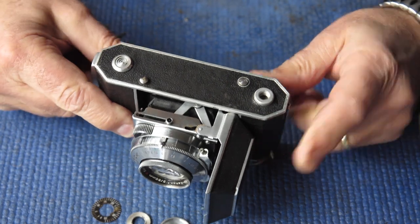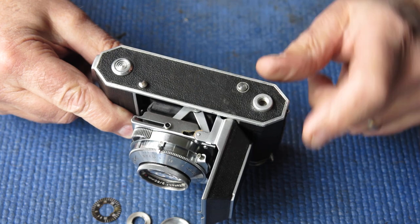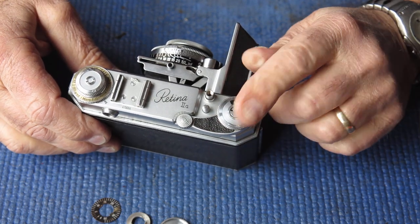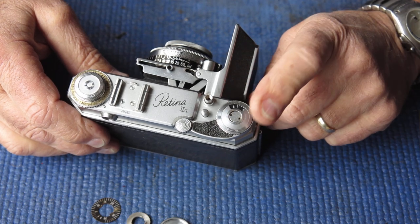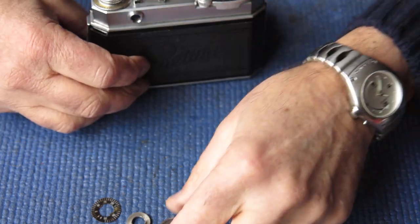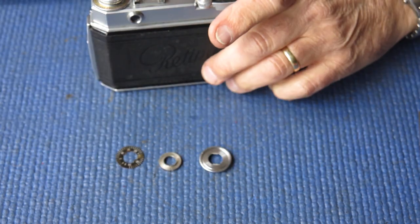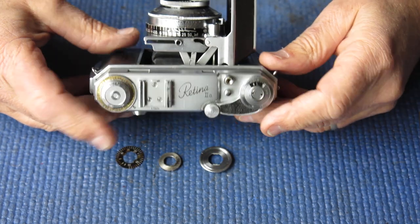The rangefinder needed cleaning and adjusting — that's quite normal. The leather on the base of the camera had horrible thick black tarry muck for adhesive — that's been dealt with. The film advance lever's frame counter pawl spring was broken and needed to be replaced. But that wasn't the only problem — the counter components were all badly damaged and needed to be replaced. But that's all sorted out.